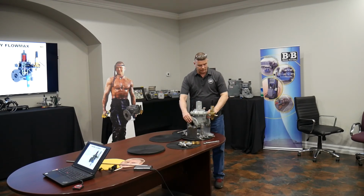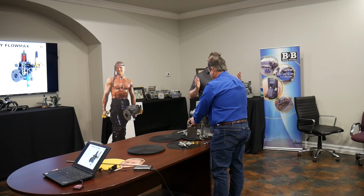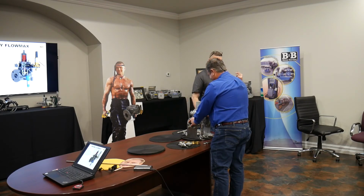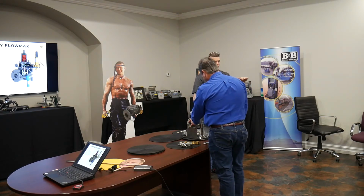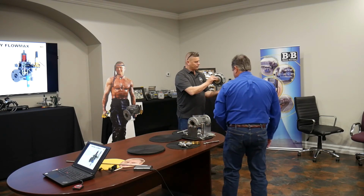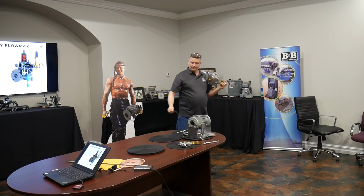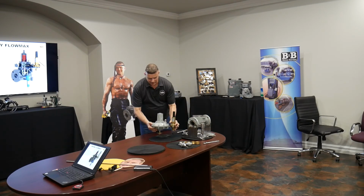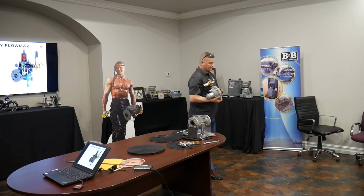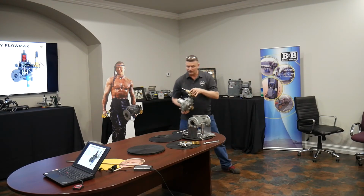Do you mind holding right here? There's an O-ring seal that actually is the gas seal. There's also a cheesy gasket, which is really nothing more than a hindrance. When the customer first tries to take this apart, if it's bound with paint, it'll probably tear, so we always have to cut it the first time. But it's basically a turn and twist up. This is the weather seal, just to keep things from getting in there. But this is the real gas seal right here. If anything was left out, it couldn't get any farther than this ledge anyway. And on the 6-inch version, there isn't a gasket.